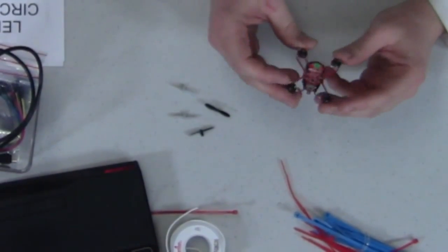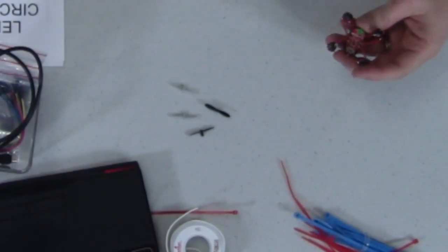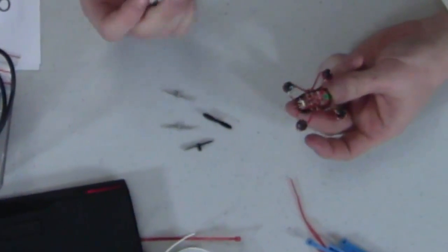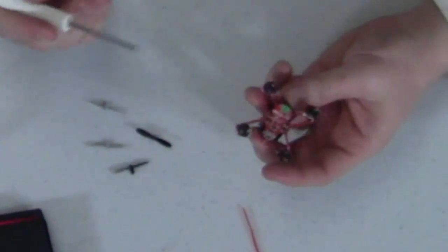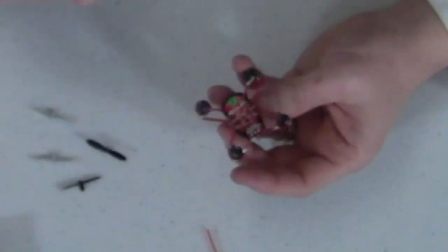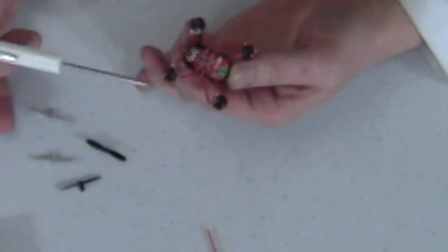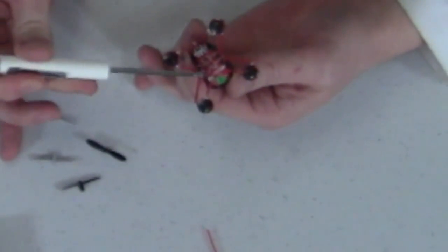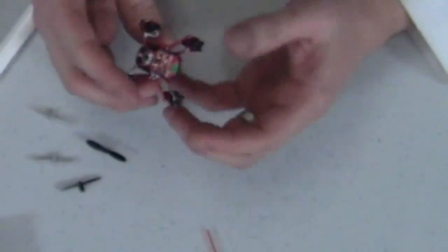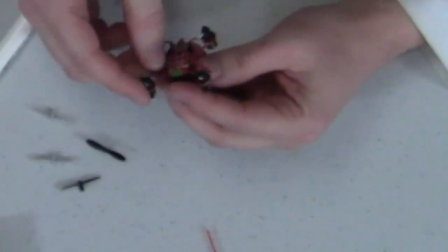Before I get into the shroud, I'll show you a couple of the basic organs on the bottom side of the board. You can see your four major motors — that is the crux of the quadcopter, providing the lifting force. Typically motors will draw more current than a microcontroller is going to want to provide naturally, so it's good to have some kind of switching circuit such as a transistor to handle the motor loads as an intermediary between the motor and the controller.